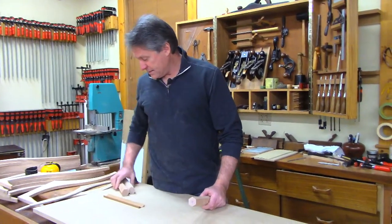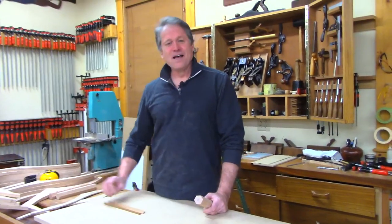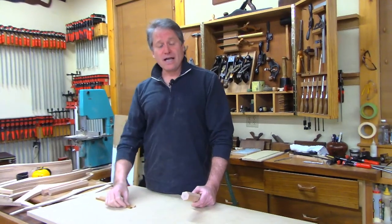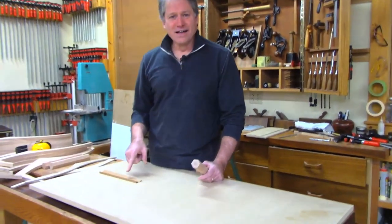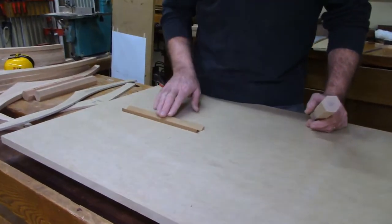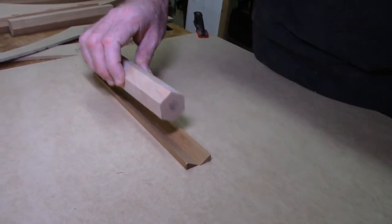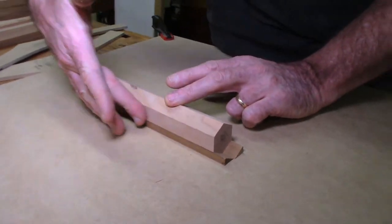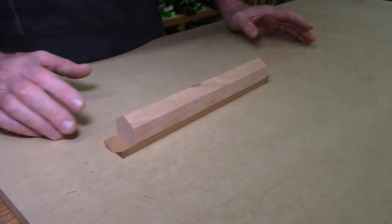While still set up at 30 degrees on the table saw, I ripped a couple of 30-degree scrap strips and tacked them to the table — making a little cradle or seat that comes in at 30 and 30 degrees. My hexagon sits right in there, it won't wobble, and by doing that this edge is now at 90 degrees to the table — a nice point of reference.